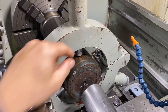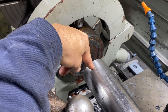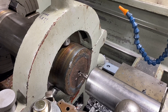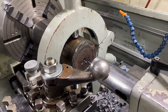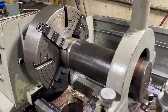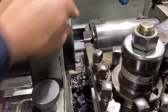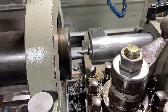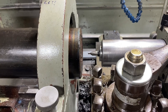You sweep and indicate to the tailstock spindle. There are a whole bunch of other ways of doing it and they're all good — if it works for you, that's awesome. But if the part weighs five tons you're not going to be able to do some of them. And of course if the part is non-magnetic you're not going to be able to attach your magnetic indicator base directly to the component; you'll have to use some sort of clamp arrangement, which we'll talk about later.